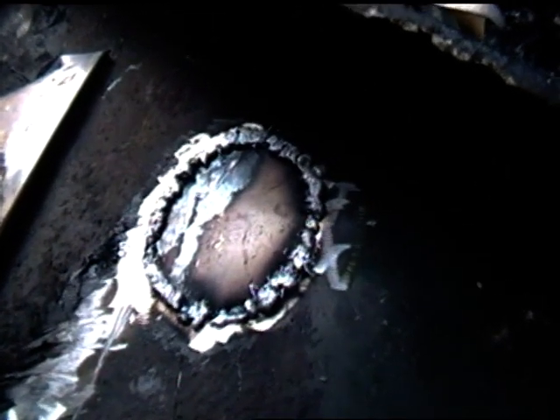I've just taken the scrap of stainless - well, stainless steel is an alloy - but a piece of scrap steel off the back. It wasn't clamped up particularly well, I was just doing this as a quick lash-up. So there was a gap and you can see where the aluminium's pulled through. But it won't bond to the stainless steel - it's just pulled through and sat on the back. So I'm going to grind that off, then go over this side with the MIG and tidy it all up, do a nice weld around on the back end.